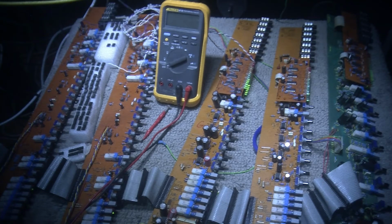And I'm going through and I'm cleaning each fader. The other issue with the faders is that the brushes in the faders are pretty worn. So the faders got really good use, and the brushes are worn. They are still working, but you can tell that the faders are not going to last 20 more years, I doubt, without some needing to be replaced. I looked, and you can actually buy the faders from Germany for about $7 a piece plus shipping. So that's quite expensive.